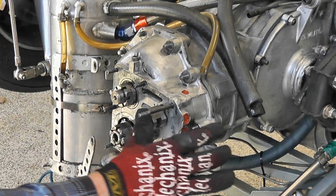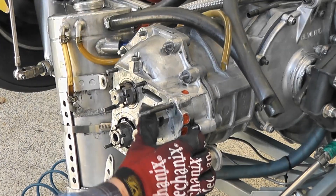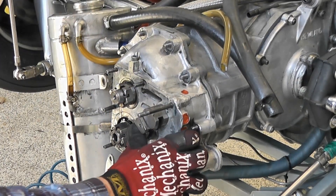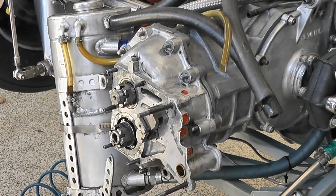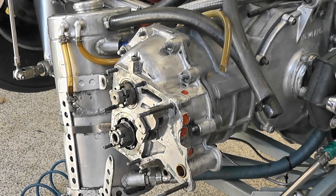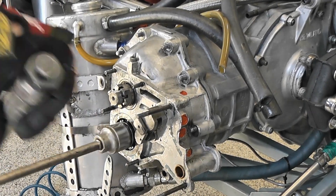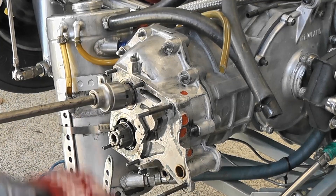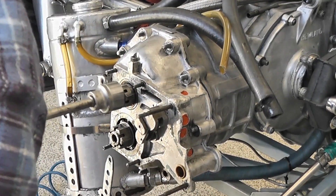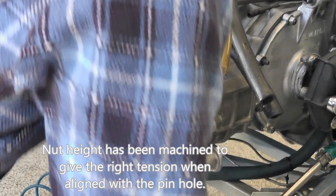Remember it is left-hand thread — it goes the other way. It's in. We now have to lock these gears up. Fourth gear's first — rotate it in. Reverse gear second — rotate it in. Now we do them up. There are some prescribed tensions, but we've made these nuts big enough that just with the nut, when they're on the right holes, they're perfectly tight.